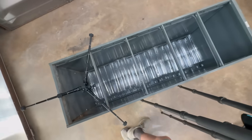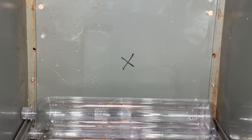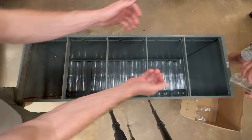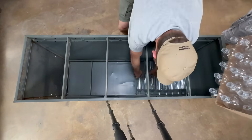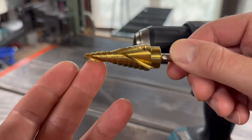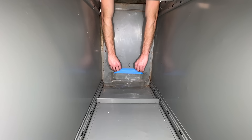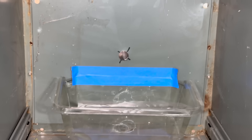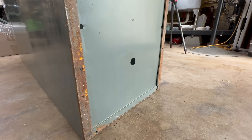Once it's apparent where the top of your water reservoir is going to sit, it's time to drill the hole for the bulkhead fitting. You want this hole to be right around the top of the reservoirs — this allows the maximum amount of water storage and airflow. You will need to remove the reservoirs to install the liner anyway, so you might as well do it now. To drill the hole for the bulkhead fitting, a step-up drill bit is the fastest method. Because any metal filings could puncture your plastic sheet in future steps, it's a good idea to remove any leftover metal filings the step-up drill bit generated.